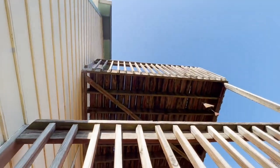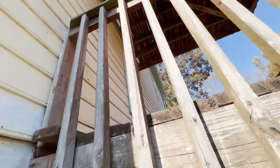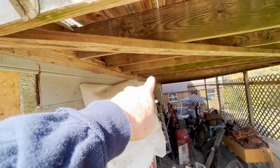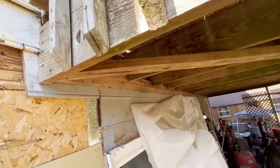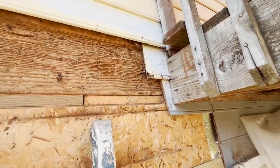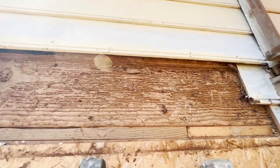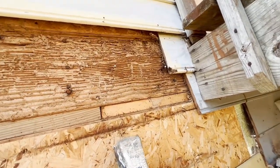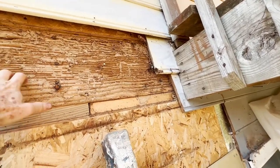Because I'm going to replace this in five-foot sections. Another concern: there are two decks and both decks actually have to come down — neither one of them is properly attached. Probably only that end is holding up the entire deck. But I'm not worried about taking down just this one little section so I can get at what's left and bang it out. I will support it from the inside, although the joists are resting on the end of the sill plate, so this section is doing nothing.